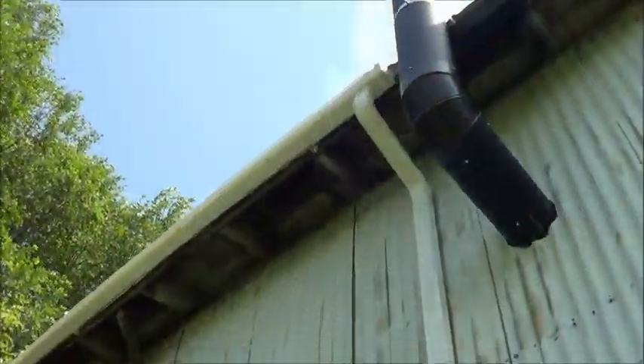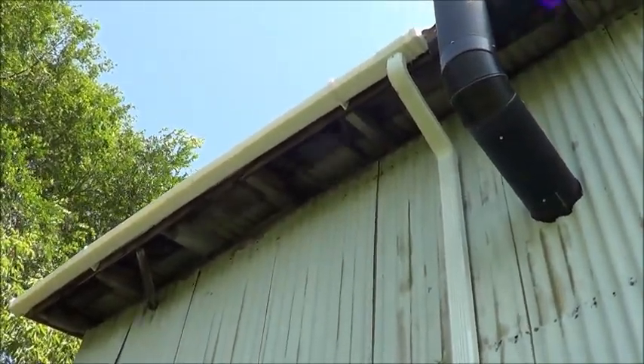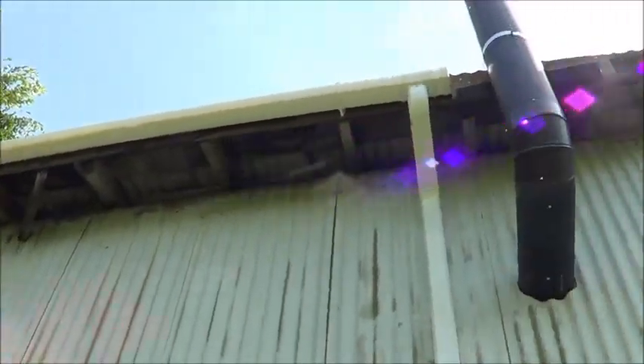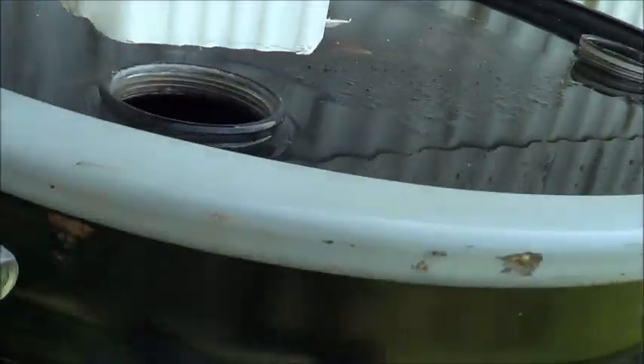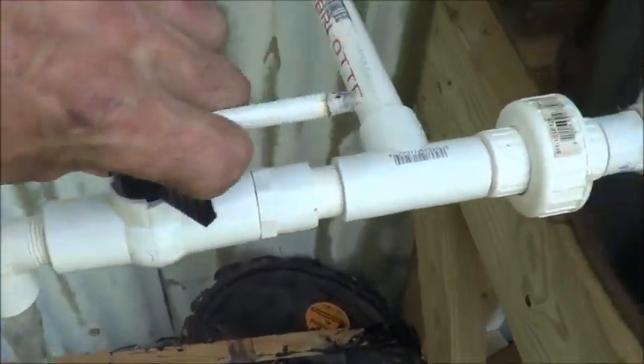While I'm out there - I put just 10 feet of rain gutter on this roof, and there's another roof that flows into it, so it's like 20 feet of roof catching down into a drain into a 55-gallon barrel which I put a bulkhead on. This line runs into the shop into the sink, and I also have a spigot here in case I want some water. That's my rain collection under pressure.